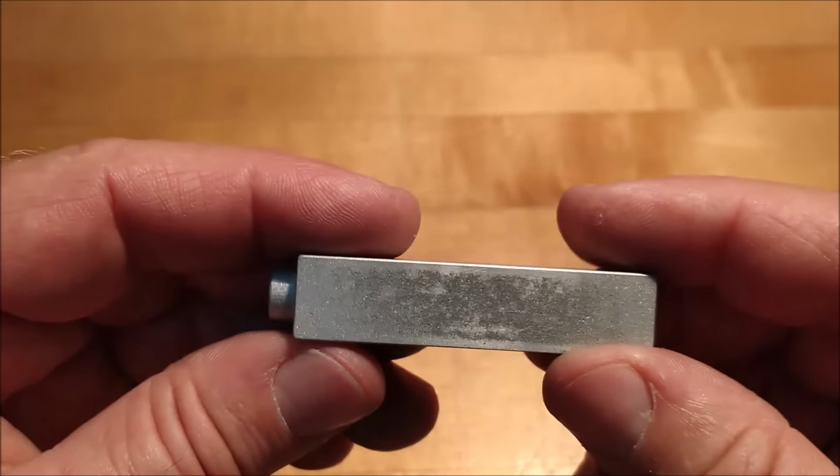There are centerline dimensions given to the center of the boss in relationship to these two surfaces. So initially, when I clean this up, I just want to barely touch this. I'd rather not touch it at all if I don't have to, but like I said, I can always clean that up in the end. I'm just going to clean these up to establish a clean surface so that I can flip it and hold it probably on skinny parallels and establish the top deck, and then I can bring the center line in that's given to the center of the bosses this way. Let's do it.